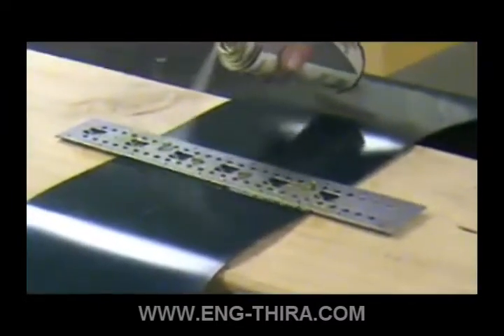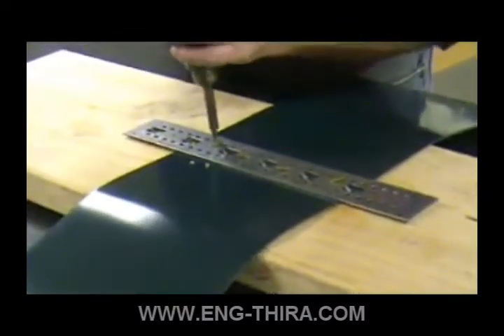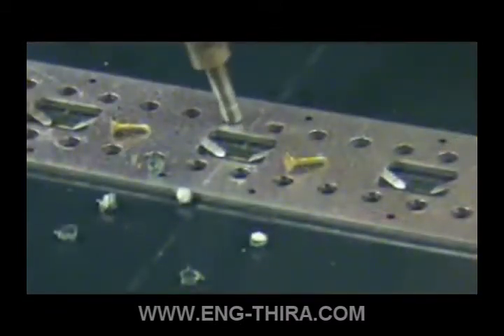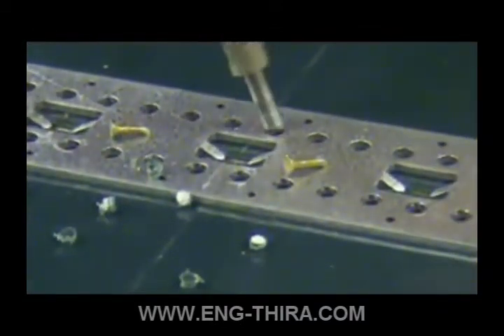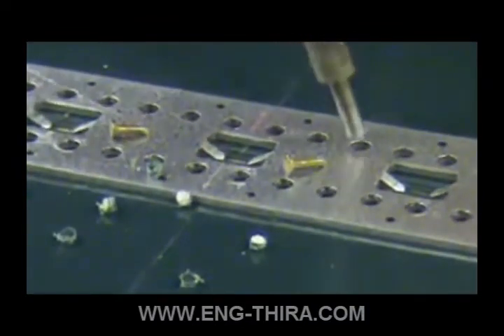Using a 3/8 inch drill and the proper APF punch, spray the alligator plastic rivet lube into the holes of the template and drill the holes through the belt. Be sure not to drill the holes up to the edge of the belt. Leave 1/4 inch of the belt at each edge open for notching.